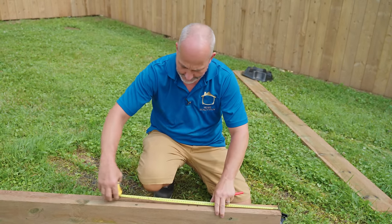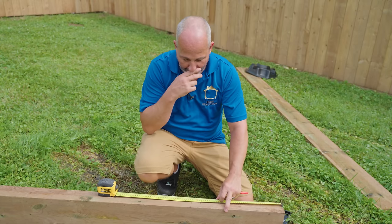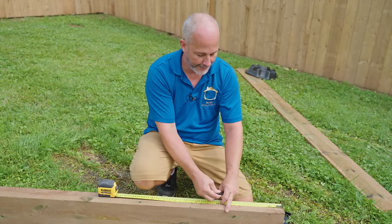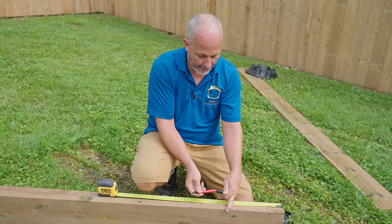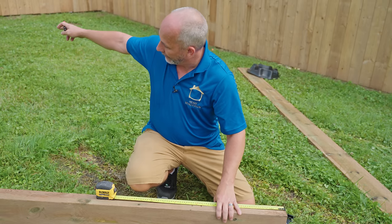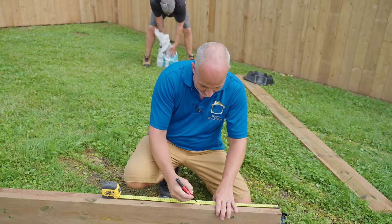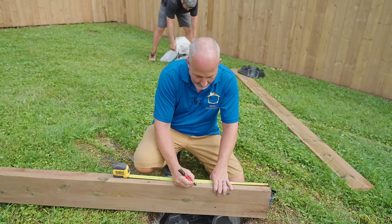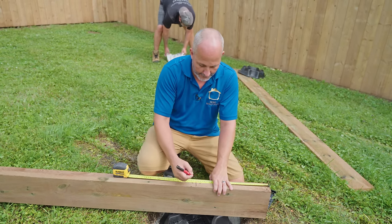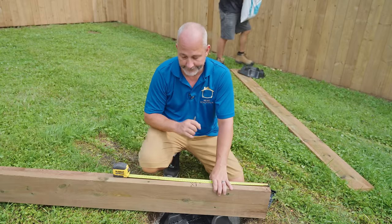All right, let's go to basic framing — you're going to go every 16 inches on center. Best practice is to have both rim joists marked in the same location when you do this. I've seen it so many times — you'll have one guy over here marking from 16 and the other guy will go over and do the same thing from the other side, and all your joists are on an angle across your deck. 16-inch on center means we mark 16 inches and then put the board from that line over.